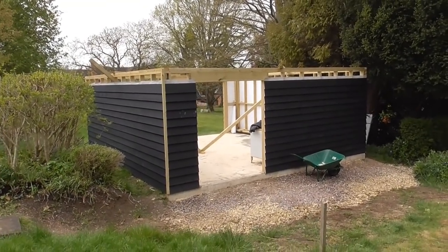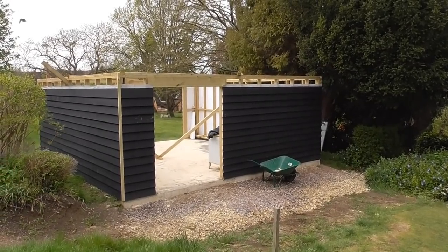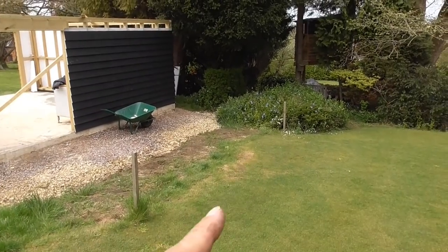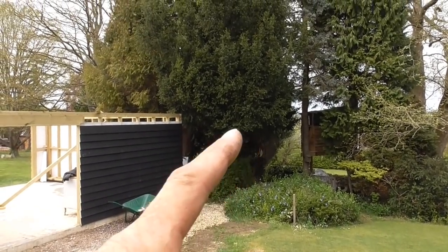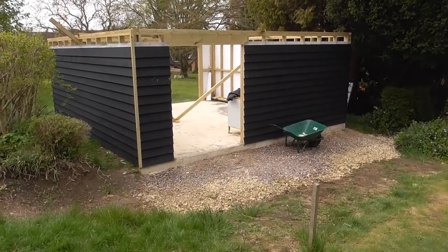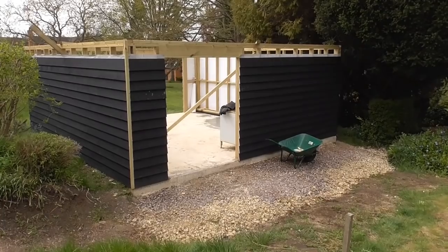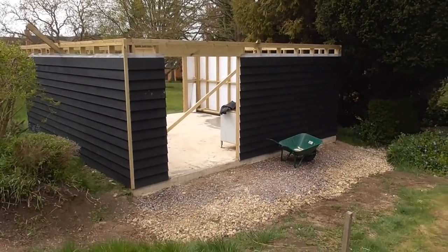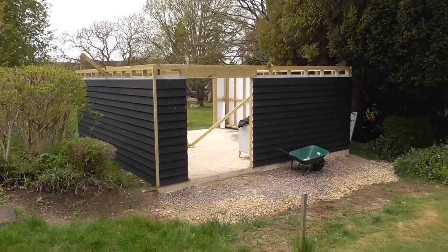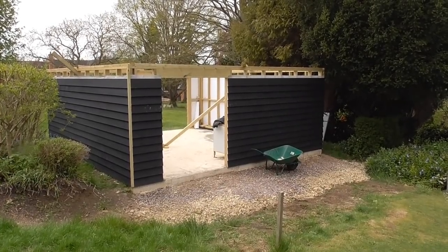Finished for another day — really happy, had a good couple of days on this, pushed it right forward. Got all the feather boarding up to a certain height; I don't want to go any higher because I've got a gable end here and the roof still needs to go on. We'll get it scaffolded — there are two concrete pads going in down here to take some posts and a frame which will take another roof cutting into the main roof. Got it all fixed down to the concrete with angle brackets and resin anchor, so I'm really happy that's not going anywhere. Put some temporary braces in — making good progress overall. Onwards and upwards. I hope you've found this interesting — it's a cracking job and I'll bring the next part to you when I do it. Thanks for watching.